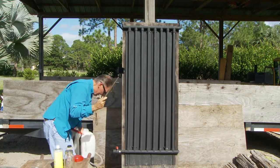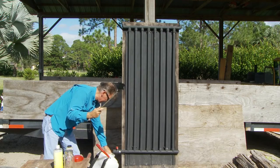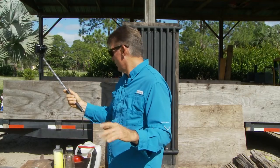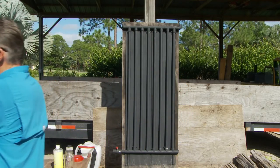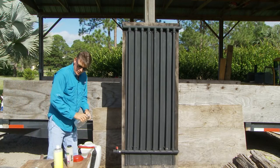I've got to get a hose on this thing — there's my little hose blocking it. I can stick it under here like this, fill it up with some nice heated water, and that'll keep the oil from coagulating. What happens is — and I've done it, don't recommend it — don't let it sit and pick the sprayer back up because it will coagulate once it gets cold. You start pumping and your nozzle gets clogged. Whatever you do, use it all, rinse it out good, and avoid having to take that nozzle out and clean it.